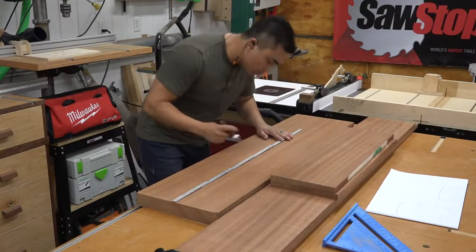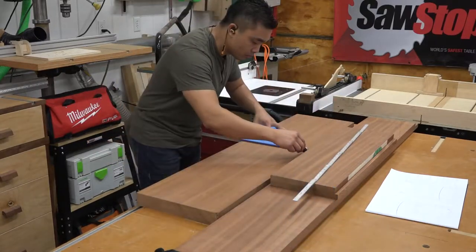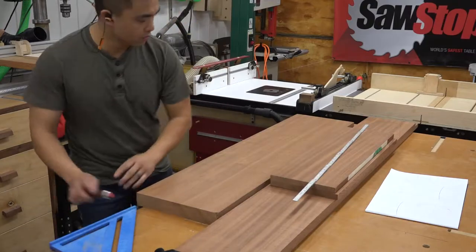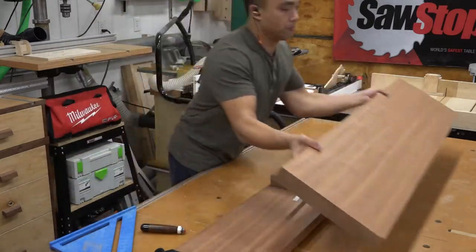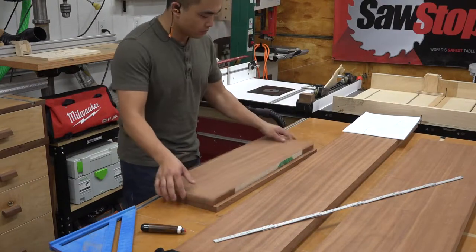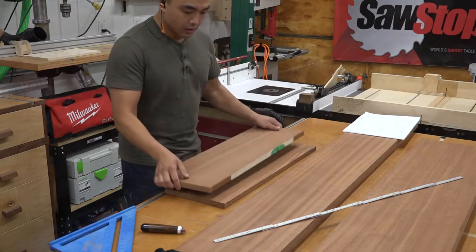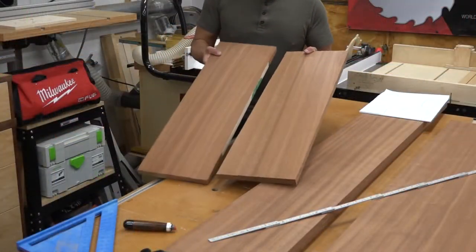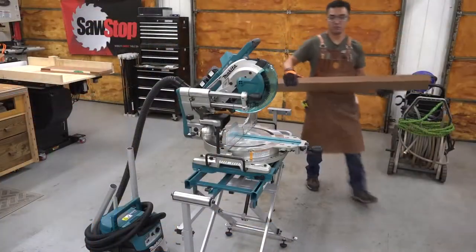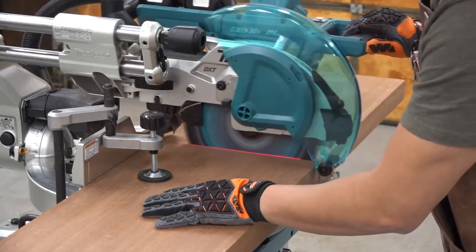As I continue to grow as a woodworker I'll often try to build furniture or cabinet pieces that incorporate new techniques and methods. I like to challenge myself by doing something I've never done before. In this case I'm building a drop leaf side table as a gift for my mother-in-law. The drop leaves will have a rule joint. When the drop leaf is extended this joint makes a tight, well-supported connection, while in the down position the rule joint makes an appealing round over that conceals the hinges and transitions well into the center portion of the tabletop.